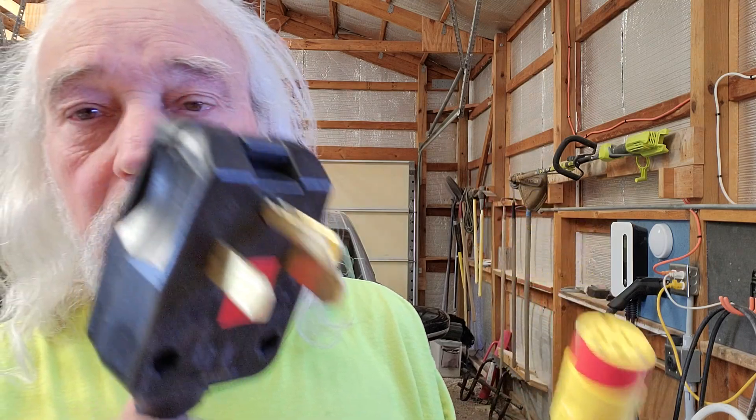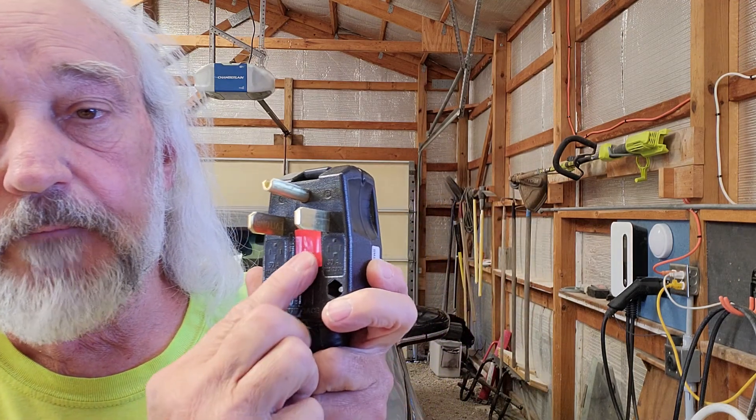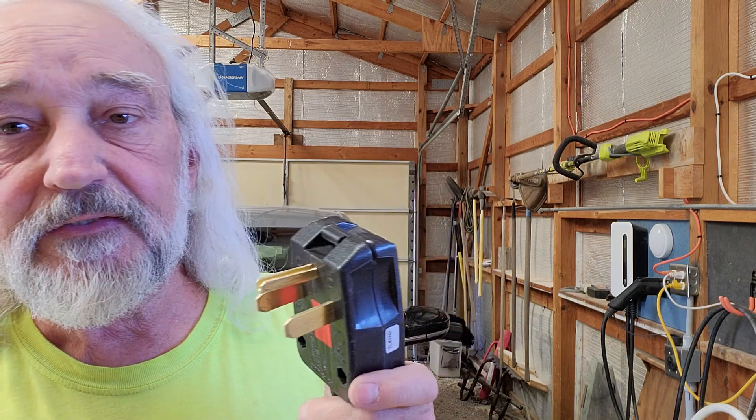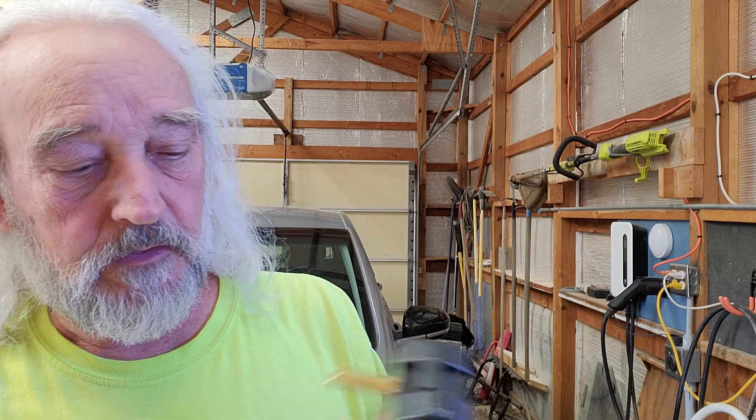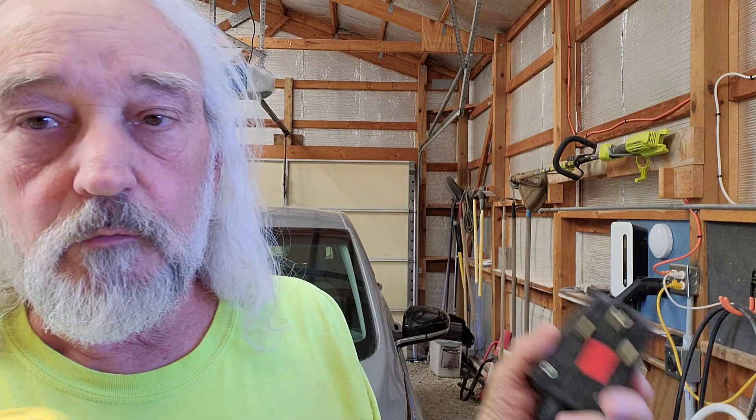Here's the one I made up for the parks. This is going to plug into a 50 amp service. The 50 amp plug normally has a neutral right here, which I've covered with tape — I just did that to keep insects out, because I don't really need the neutral. There is no place at this end of the plug to attach a neutral. We used this at Caballo Lake on two separate nights and it worked great. The car charged twice as fast — I can get 100 miles a night out of it easily, charging the car up. We did some day tripping there and it worked out great.